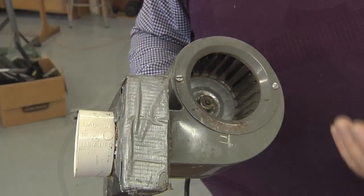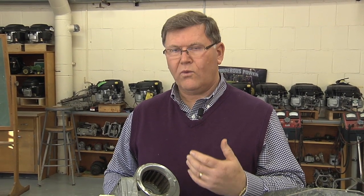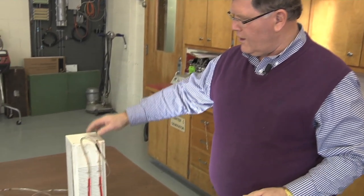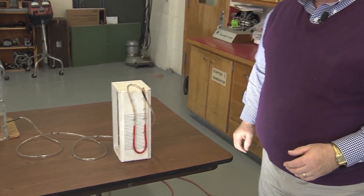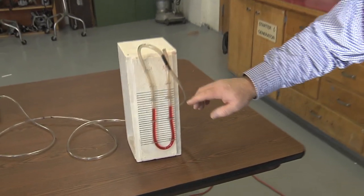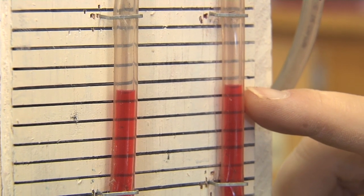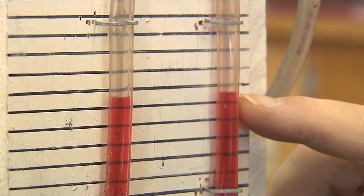It's very important that we understand the operating performance and characteristics of each fan — what airflow they can deliver and what static pressures they're designed to work against. Now we have the fan hooked up to the bin with our U-tube manometer connected to the underfloor area, but we're not moving any airflow. With no airflow, we expect no resistance or static pressure. Looking at the U-tube manometer, both water levels are at the same height, indicating no static pressure.